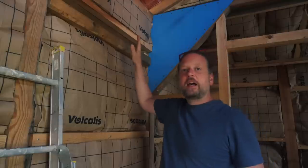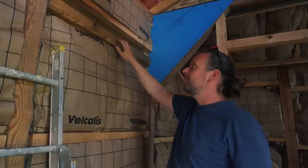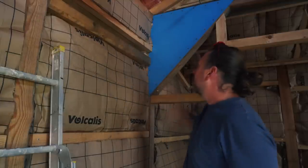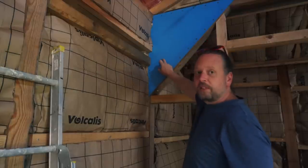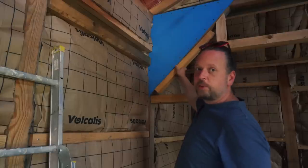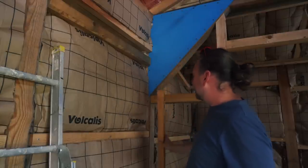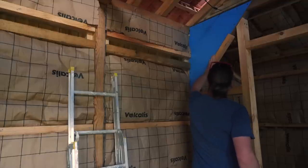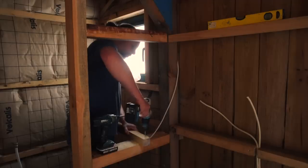And so yesterday we were putting in these much thicker pieces that were attached to the posts specifically to hold up cupboards. Now, when we're going to do the wall around here, there's not a lot to stick on because of this metal, so we're trying to add more points for the plasterboard to be attached to. So I'm going to be putting some extra bits of wood, say here and here, so the wall can be attached to this bit of stud work. That's my plan today, and also to finish more insulation. And yeah, we really need to hurry things up now, so the pressure's feeling much greater than before.